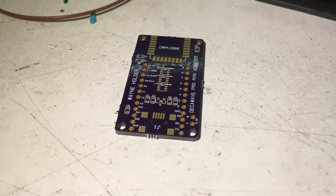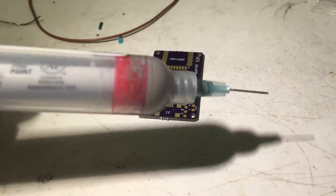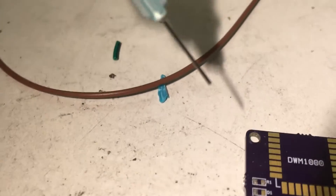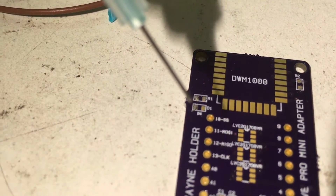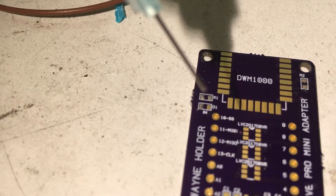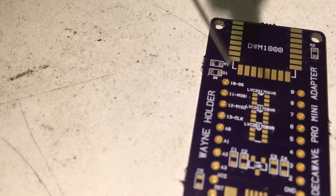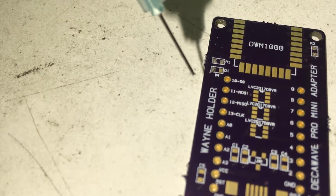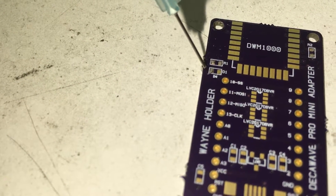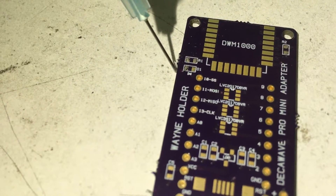For anyone who has been wondering how I put one of these devices together, I actually use a little solder paste syringe like this, and I can deposit little droplets of solder right on each of the pads as a starting point. It's a little tedious, mostly because I use a fine enough nozzle and I have to bear down a fair amount of pressure to actually get the paste to come out, but it's really not that hard to master.